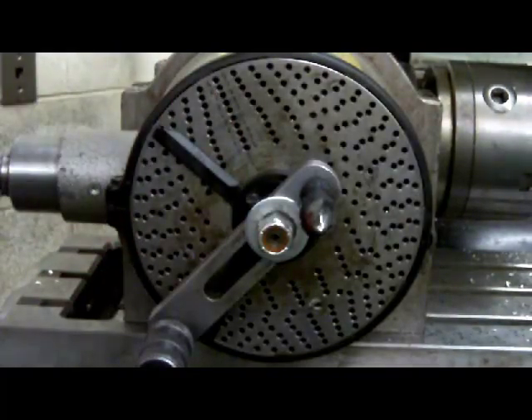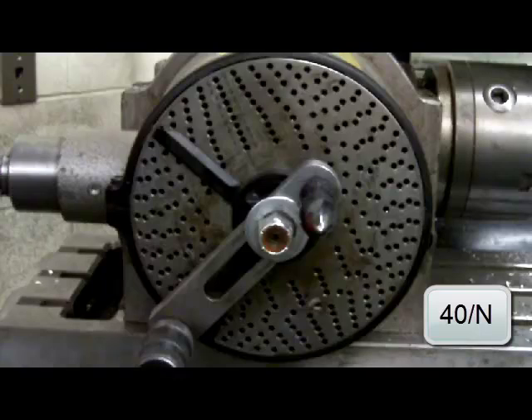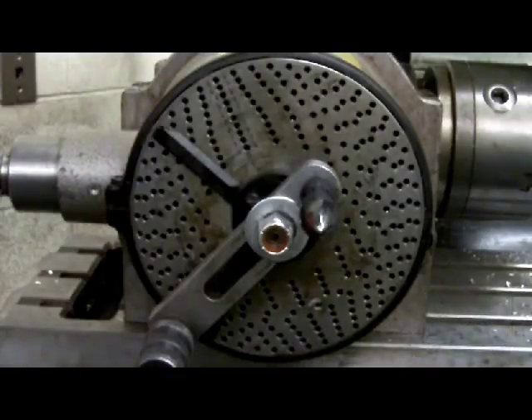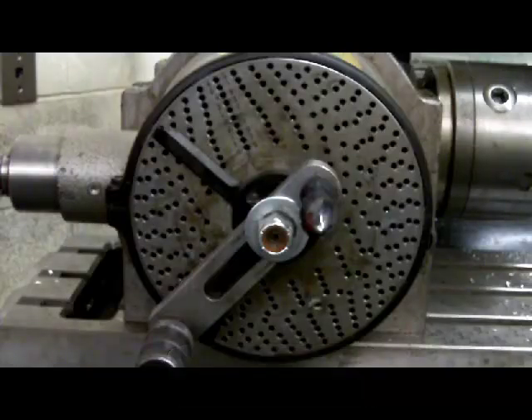Depending on the manufacturer of the hole plate, we will have several different ranges of hole circles. There will be a few different plates for the dividing head. If we take the seven divisions required and use simple indexing, the formula is 40 — because there are 40 teeth on the worm gear — divided by the number of divisions required. In this case, because we want seven flats, it would be 40 divided by 7, which works out to 5 and 5/7ths of a turn. Because we have a mixed fraction we can't use direct indexing, so we have to use simple or plain indexing with the worm engaged, making a 40 to 1 gear reduction.